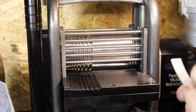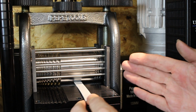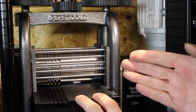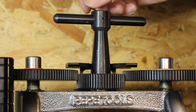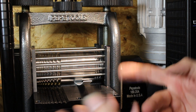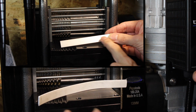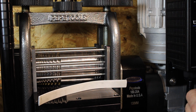If you're using a manual rolling mill, you tend to have to be side on to it because you've got to wind the handle. The unit is incredibly powerful and this will roll material much thicker and much more aggressively than what you could do by hand. Treat it like you would a manual one. Quarter of a turn at a time. Work your material nice and gently and you're going to get nice, good results. Don't try to force things through it because you could potentially cause damage to the gearbox or to the motor.